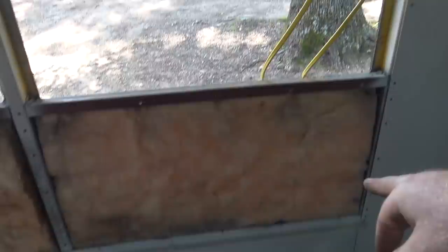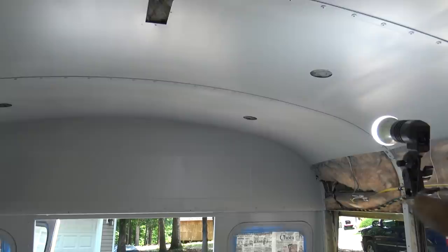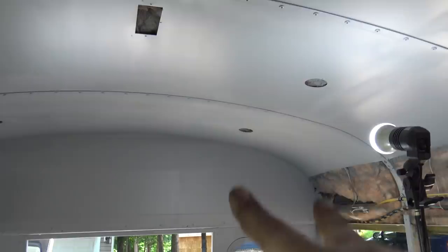All we have to do is cut the hole and extend the wire from this hole over to the hole we cut. That runs to this wire, which is also going to go down the wall through external conduit all the way down there to a light switch. Then we have a line running from that light switch down and tie into this outlet that's going to be right here. Basically the outlet in here for general use, like cell phone charging, is also going to be feeding the bathroom lights. That makes sense to you, Daniel?